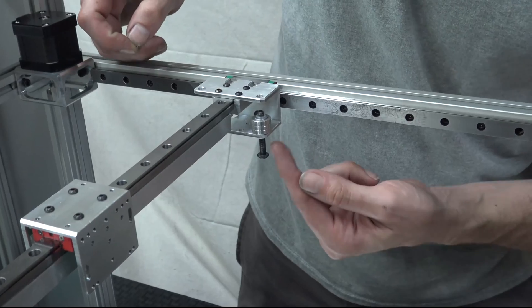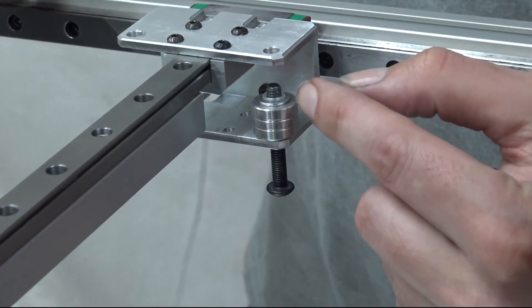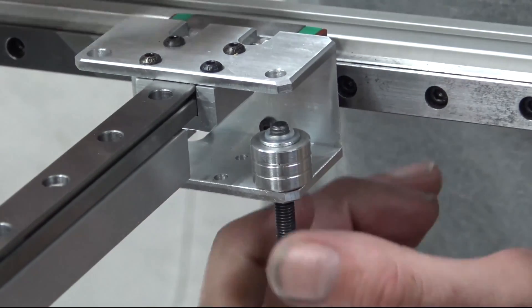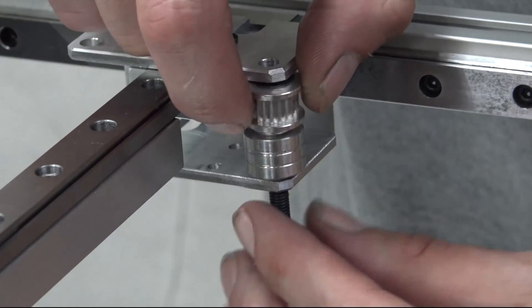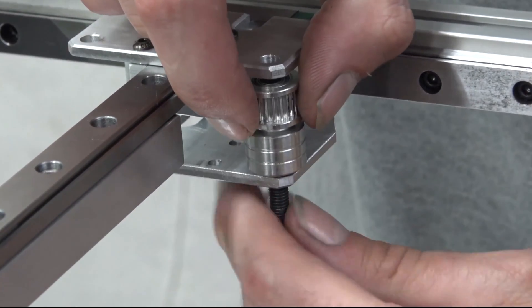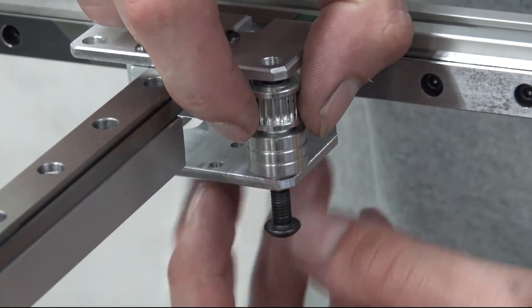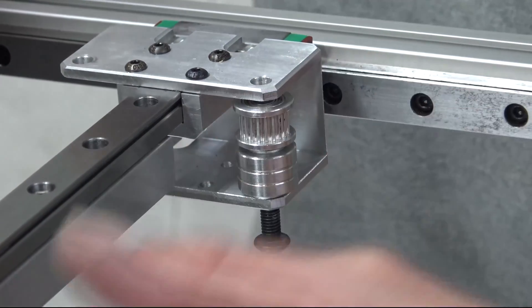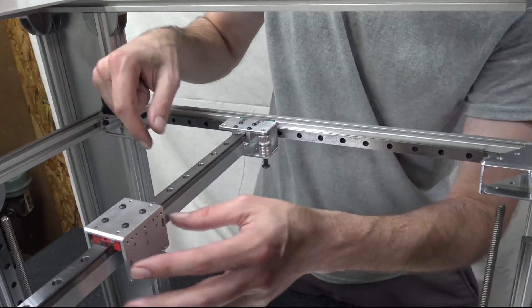So the stack is: a 5mm washer, the spacer, another 5mm washer, a nylon washer, then I'm going to put a toothed pulley here. You don't have to use toothed pulleys — I just prefer it because it grips the timing belt better, because we want to print at high speeds. We're aiming to have a high-speed printer. We can make these smaller and lighter by cutting little pockets in them — we're working on that, we're not there yet.